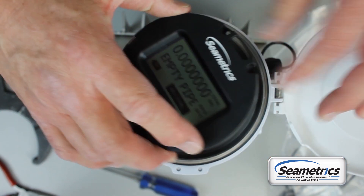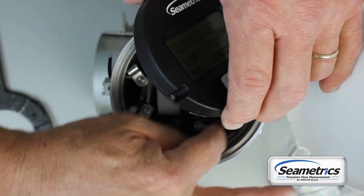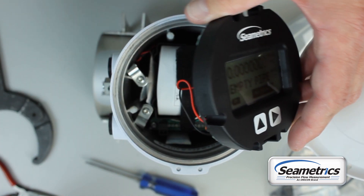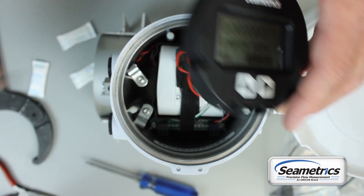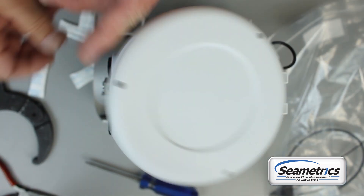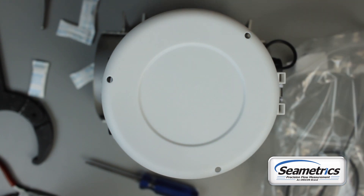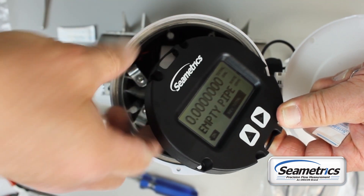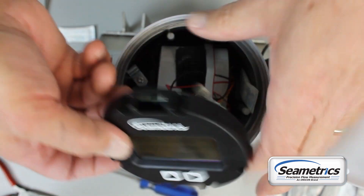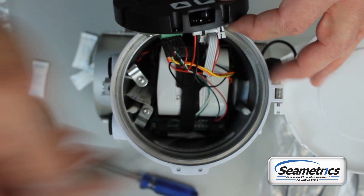Make sure that there are no wires in the way of any of the connectors or in the way of the threads. There are desiccant packs down inside the housing — pull those out. In your battery replacement kit there will be a bag of desiccants. Put those down inside the housing, making sure none sit too high, as that could get stuck in the threads — shove them down inside.